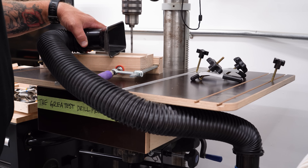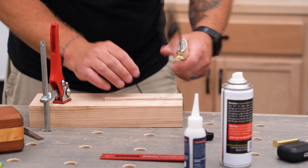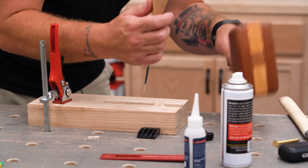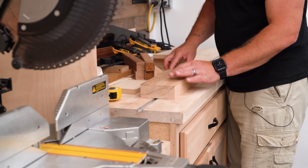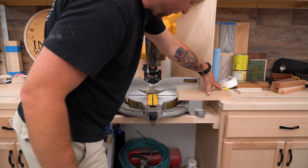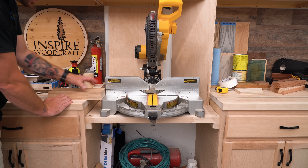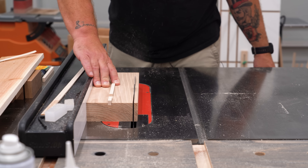This key should fit inside of here as long as I did everything right — and it does. This is just under six inches, so basically this will work for anything six inches and above. If I slide it through here, I've got a couple of tight spots, but the primary use is going to be somewhere in here, and that's going to work just fine for me. What I need to do now is drill a hole through this key and through the top face right in the center of it, and then I can install a T-bolt in here. We'll cut away the section where the T-bolt's going to land, we'll add a knob to it, and that should help secure it in place.